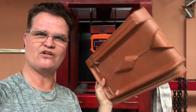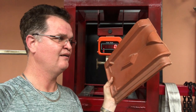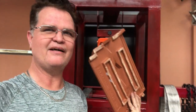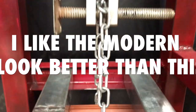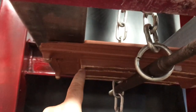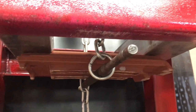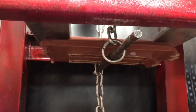I've got the next candidate for getting smashed. It's a terracotta tile — actually a bigger terracotta tile. These are a lot bigger; these are the size of the normal cement tiles we buy in Australia. But look at the ridges on the bottom of it — it should be strong. Let's put it in and see whether it's as strong as our other, maybe better quality but thinner ones. The next candidate's set up here. We've got that big thick terracotta tile in there. See how thick these ridges are underneath it. Our other terracotta tile, the industrial one from the other company, broke at 525 kilos. It'll be really interesting to see whether this one, with the really big thick ridges, stacks up against that.